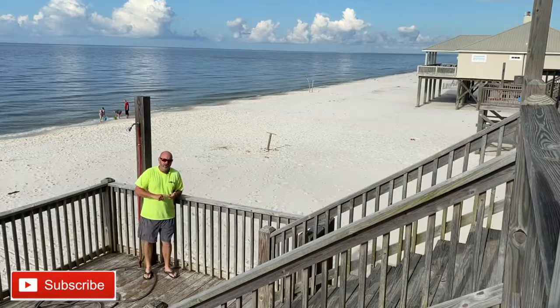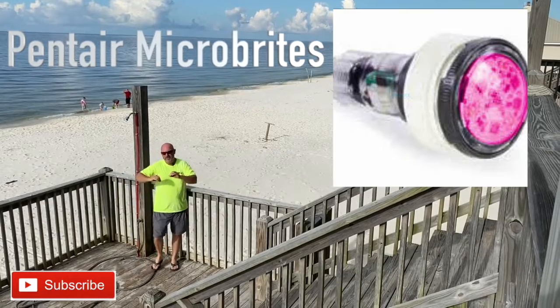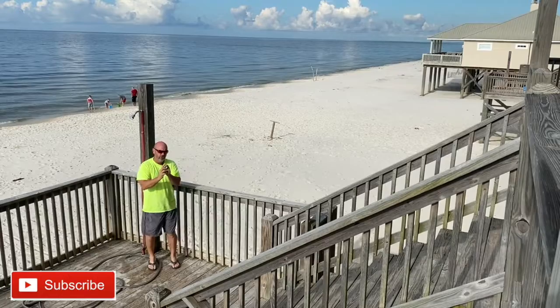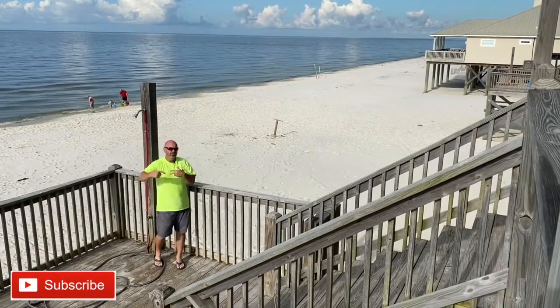I want to talk real quick. Today's video is about Microbrites, detailed install. We're selling Microbrites on every kit just about, and the dry seal directions that come with them are pretty bad. So I'm going to show you in detail how to put that O-ring in the light and install it in the wall of the pool. So that's what today's video is going to be about.